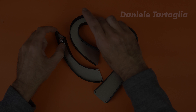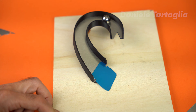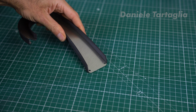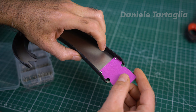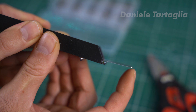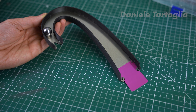But we're not done yet — we're missing the aluminum footplates. The one you see here was made by hand with scissors, but since I have a CNC, let's do it properly. They turned out great and without them, the ball would jump off the ramp. They're fixed with two tiny M2 screws and a nut. Not only do they look great, they also improve ball flow, just like in original pinball machines, and this has to be done on all three ramps.